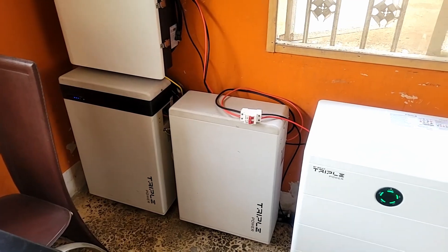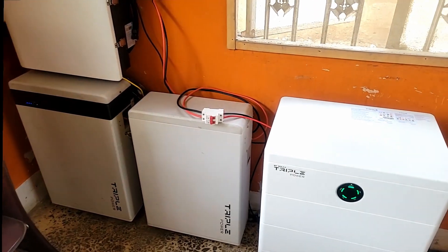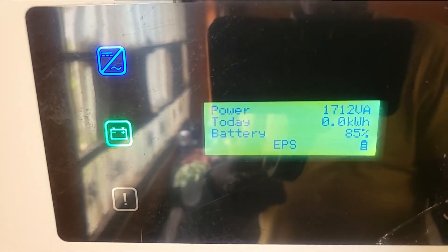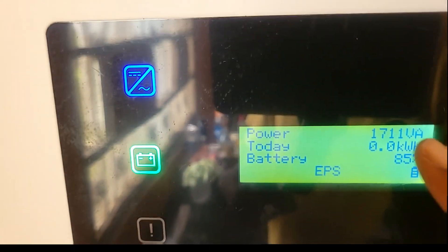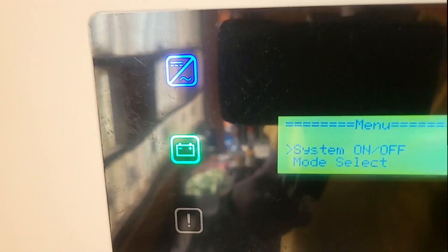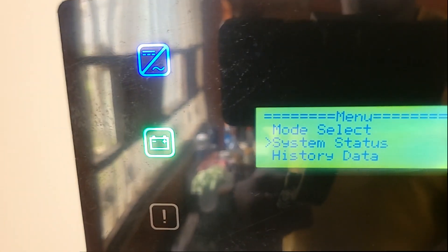So with three hours of sunshine on 7.4 kilowatts of panels, that gives me about 22.4 kilowatt hours of solar energy going into my batteries. I'm not generating that right now, which is why the batteries aren't getting full — I'm producing substantially less than needed. Between what I'm using and what I'm producing, I'm not filling these batteries to 100%.